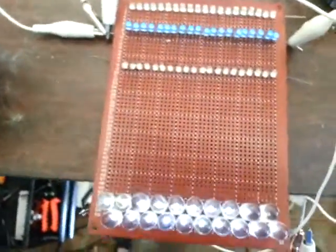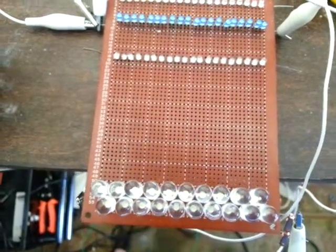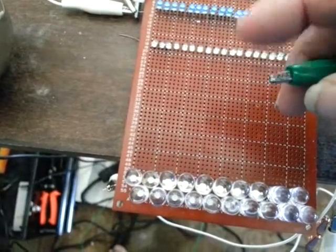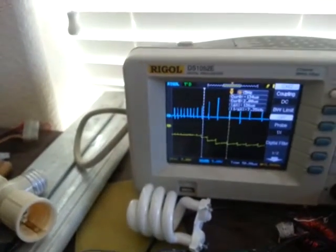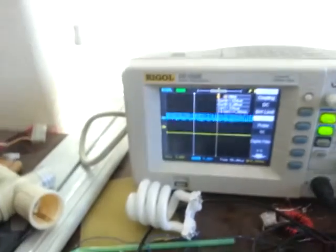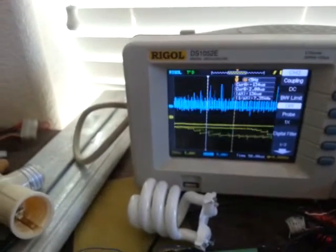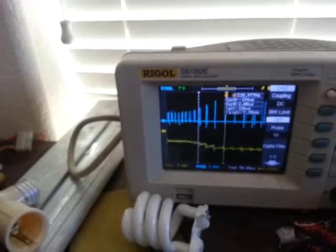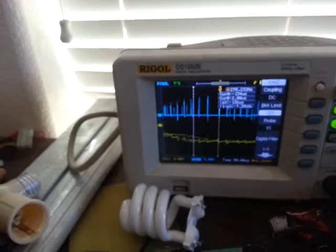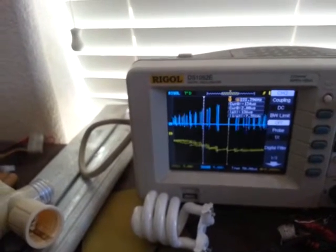Now, if I just touch this extra lead, it starts to light up the load. And the blue is that capacitor, and this other line is channel 1, which is the yellow. So it's already at a negative bias, but it's not enough to turn on the load till just a little bit. But it's only a positive pulse on the coil that's being seen, really.